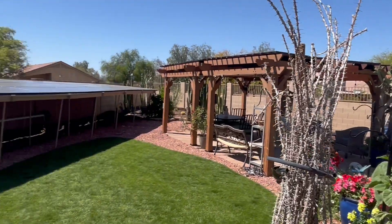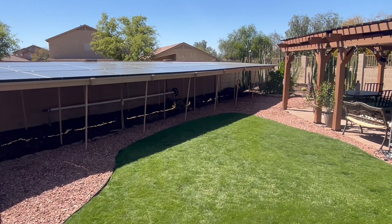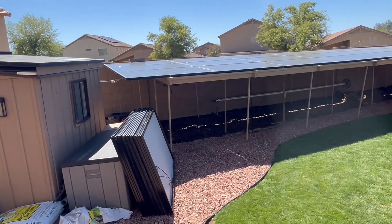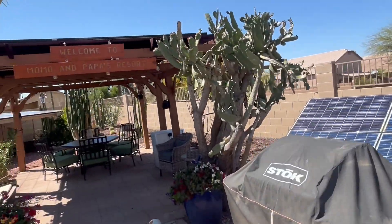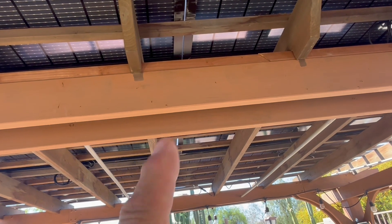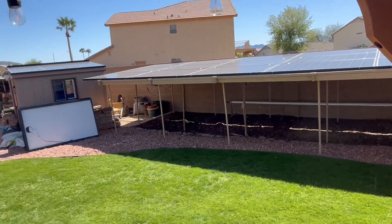We've got 10 kilowatts out of that. The sun is almost straight up above, but these older used solar panels, you don't get quite as much output. With 10 kilowatts of used solar panels, I'm bringing in 4,500 watts. With these brand new bifacials — only 4,000 watts with a potential of 5,000 watts on the backside — I'm actually bringing in 3,000 watts. Whereas with 10,000 watts of old panels, I'm only bringing in 4,500. There's a huge disparity between how well these new 400-watt bifacials work versus those old poly panels, and those old ones are in direct sun with no shade whatsoever.